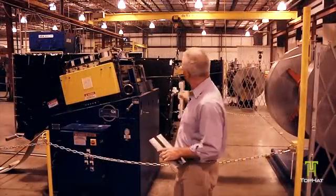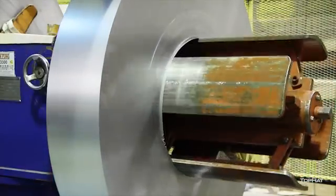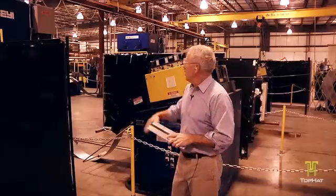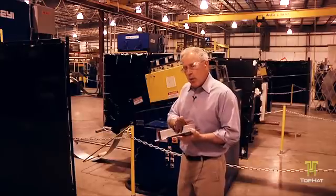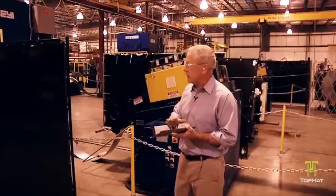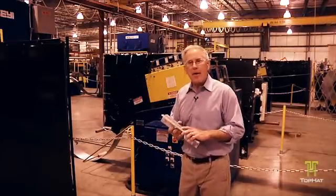There's a small motor that will tug the coil off that spool and slowly feed it into the press punch machine. If that wasn't in play, the energy stored in this coil as it spins slowly and wants to tug back would affect the punch. We want the holes to be at 12 inch centers, 18 inch centers, or 24 inch centers — whatever the run calls for — to be consistent, and this assures that it doesn't pull that coil back out of that machine.